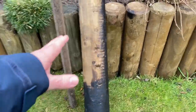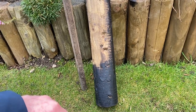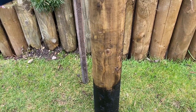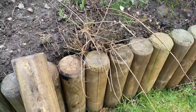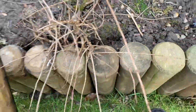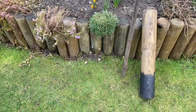The new log has been double or triple treated with a wood preserver — painting it on, letting it dry off, then painting some more on, all the way over the log. Once that's dried out, I go around with a pitch and bitumen-based wood treatment to seal, to some measure at least, the areas that are going to be in contact with the soil — the back of the log and the bottom. You can see behind the ones I've put in over the last year or so that they've been extra treated to try and give us an extra few years of longevity.